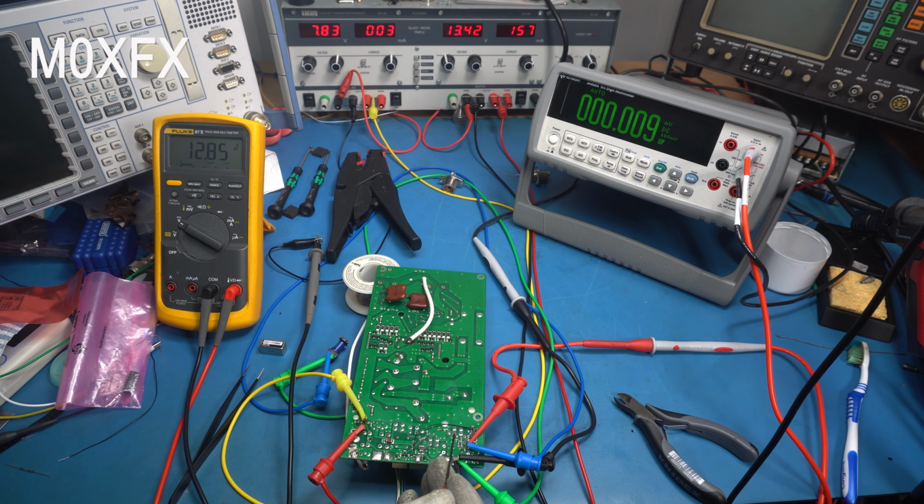So I've just got a feeling that this is how these things are. And I just didn't like it. I really don't like the idea of current going across that relay unnecessarily. And I can't see anything else wrong with the circuit. Now, before, we were getting 1.4 volts. I don't know whether that was strong enough to actually pull it in, but we can do a quick test. I can put the relay on the power supply and give it 1.4 volts, see what happens.